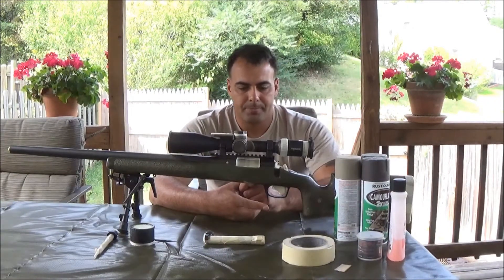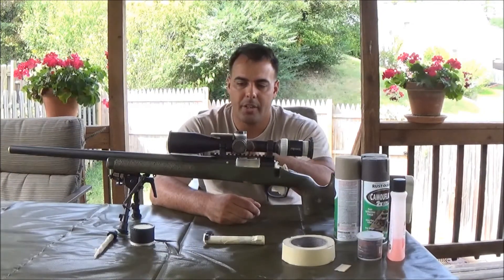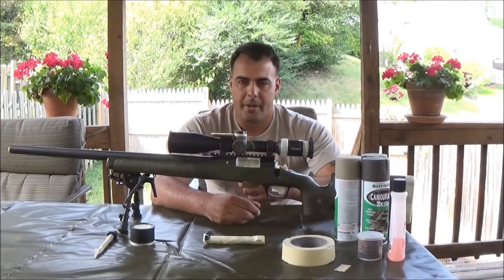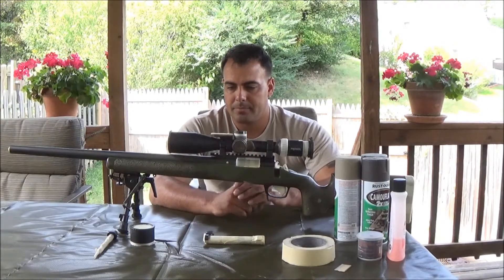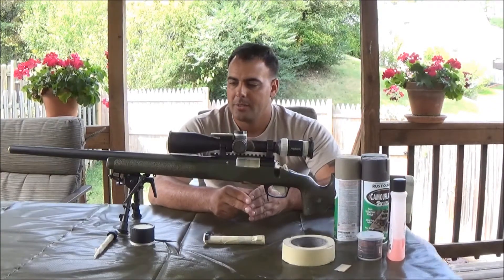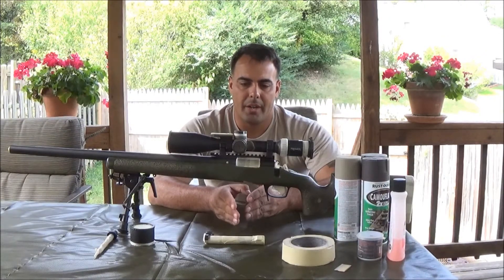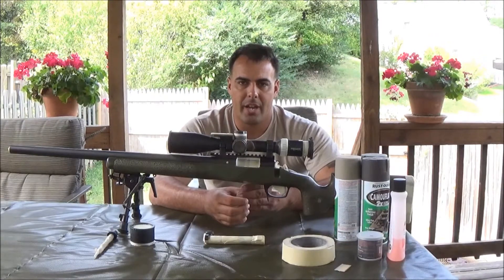Detachable bottom metal for a magazine fed gun. It had a maximized recoil lug put in — it's about twice the thickness of the original, and the gunsmith made this recoil lug himself. I had him re-thread the action, true it up, true everything inside, and give it a nice tight chamber. The chamber is 3 thousandths past the minimum, and I had the throat pushed out to be about the average for M118LR so that the ogives would barely make contact inside the throat.